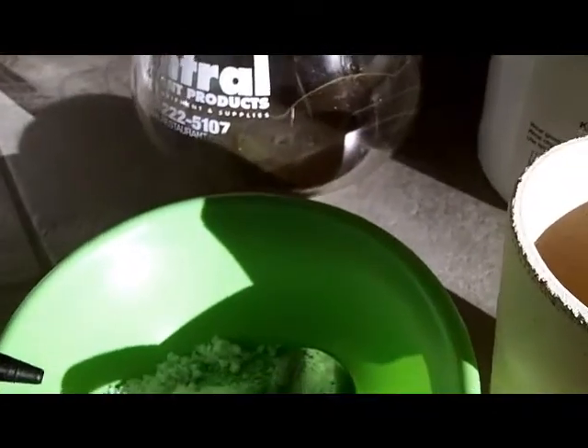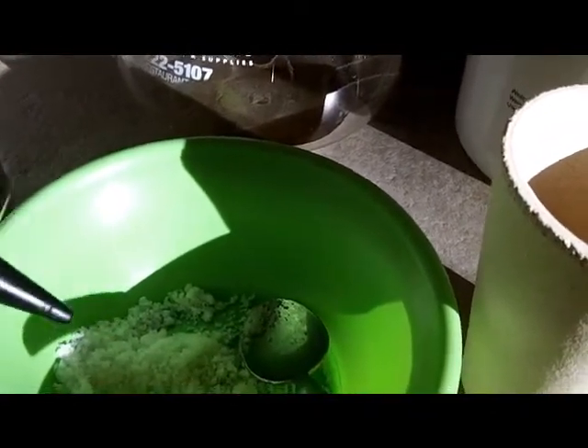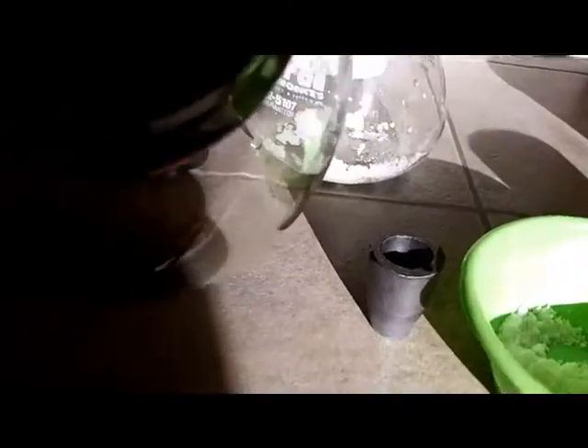I'm actually going to take this crucible back out of here for now — charge it up. Almost got potassium nitrate in there — just a little bit of that. Now I scoop the gold out of here. I have the water in there; it makes it easier to get to. I scoop it out wet — helps it stick to the inside of the crucible, less likely to blow out that way. Then my flux and stuff. The gold goes from the pot to the crucible. Just adding a few pinches of this flux stuff — water and all.